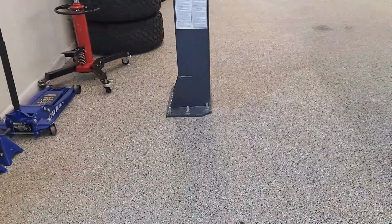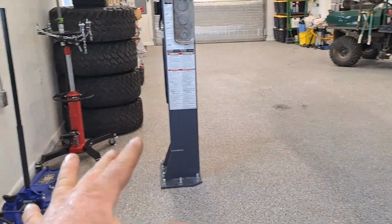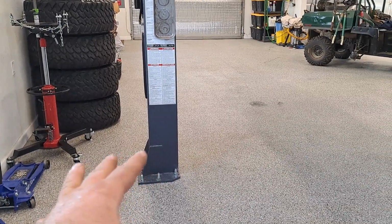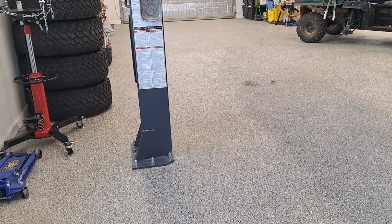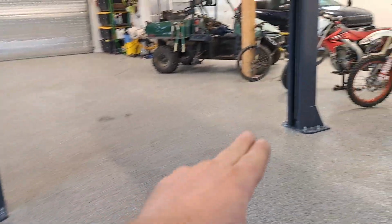They call for a 4¼ inch slab of concrete, but they say a lot of times they're really looking for about 3.5. So if you've got a 4-inch slab, you could do it. I dug down, as in an early video, and approximated where I might set this lift. Just before we poured the concrete, I pulled some sand from underneath the rebar so that I had extra thick depth right here, where those 2 posts were going to be. I kind of planned that out.